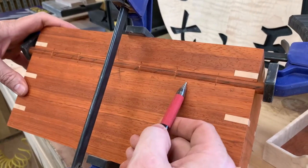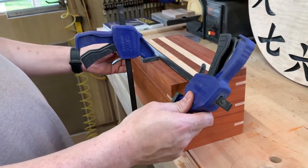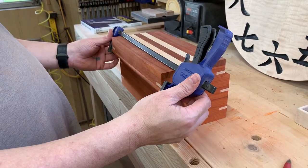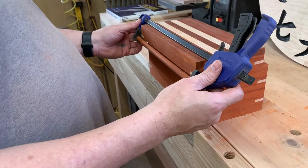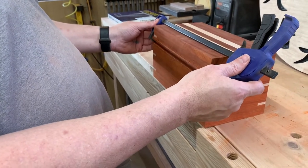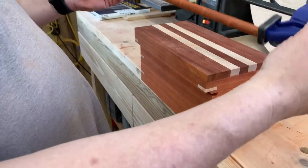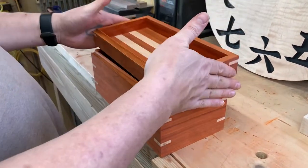We'll wax up in here, glue here. We'll wax in here, glue up in here. On to the next step. What we do is I set this here, I release the vertical pressure, I lift up here, out, take this down, and again I leave this like this so that when I've got the glue on there, I can go in here like this, pick it up with a torsional pressure, and then lay it down back where it was and clamp it in place. So really important that this doesn't move after we've captured it. So we set that aside safe. And flip this guy over.